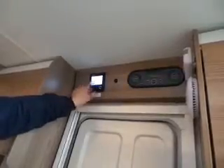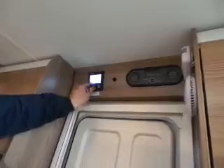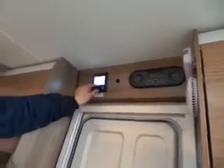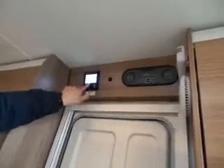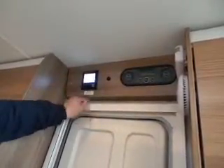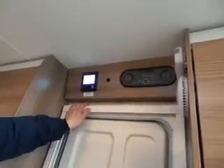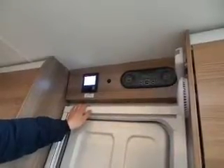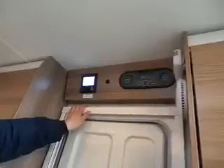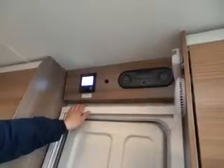Click the button again. If you want to change the temperature, click on that, set the temperature you want, click it to confirm. The next one is your water heating. Get the icon flashing, click the button. You can have water heating off — so you can run the heater without water in the tank if you want — but don't have it flat out because it can overheat.